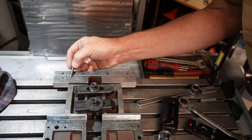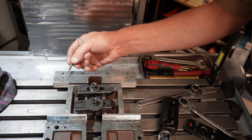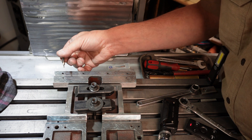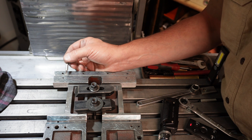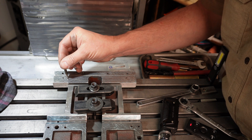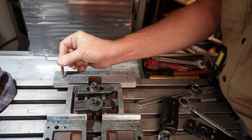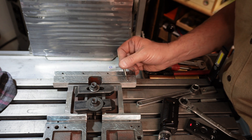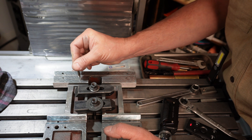Those are the existing oil grooves — they are too small. How can you oil the bearing surface? That I worked, that I ground and after I scraped. But anyway it was horrible. Now with the two-flute hand mill we will open this one following the original, but as you can see the original didn't connect to the oiler hole. So now I will go in this way and follow the existing design. First we will make two straight grooves, one here one there, and the same here and there, and after I will angle in order to make the long groove.